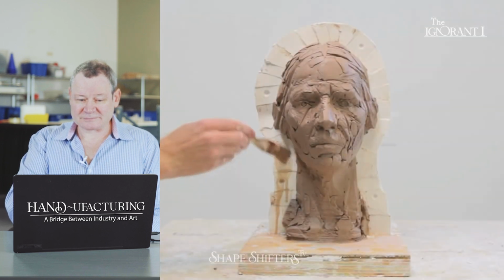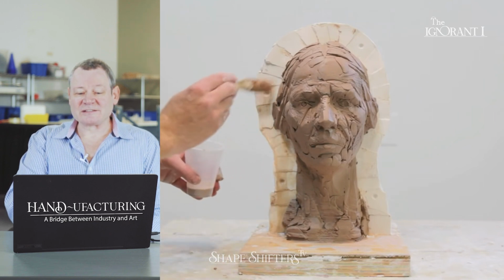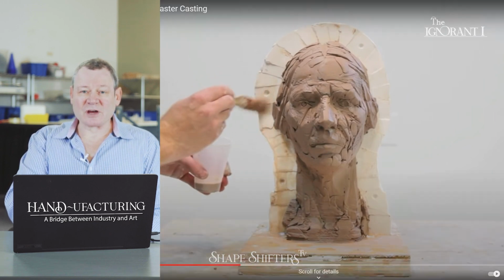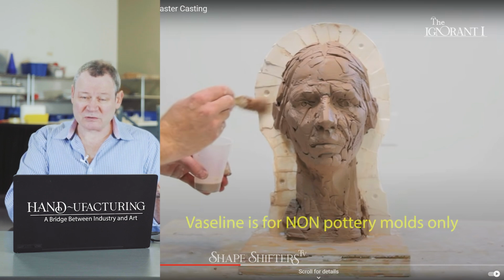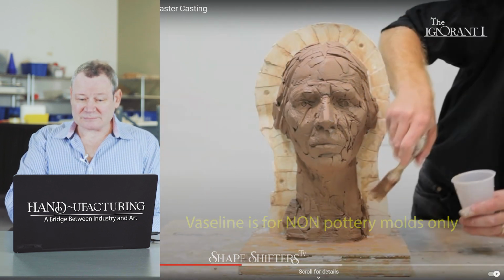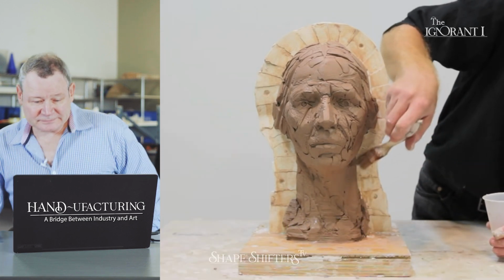Here I'm painting on a clay slip to the shim line of the mold. This is nice. A lot of people don't talk about using clay as a release agent, but it's a very organic, easy way to do. It's effective. I never used it because I didn't have slip around as much as I did mold release. I would use Vaseline. It's my go-to. It's cheap, it's at the hardware store, and it's safe. Slip is just diluted clay, or clay that's been mixed with water.